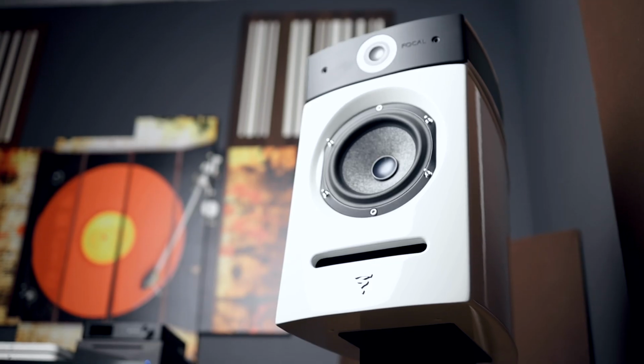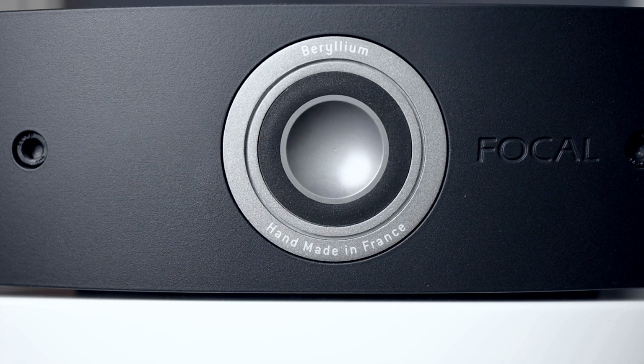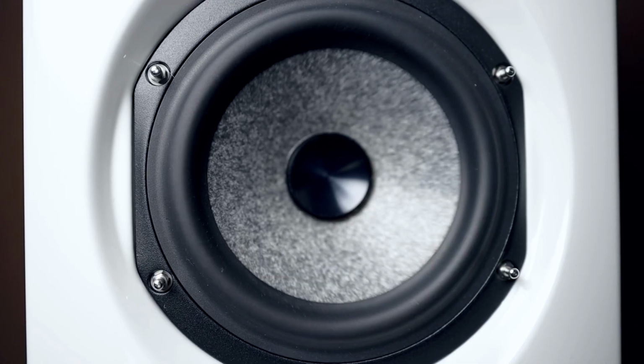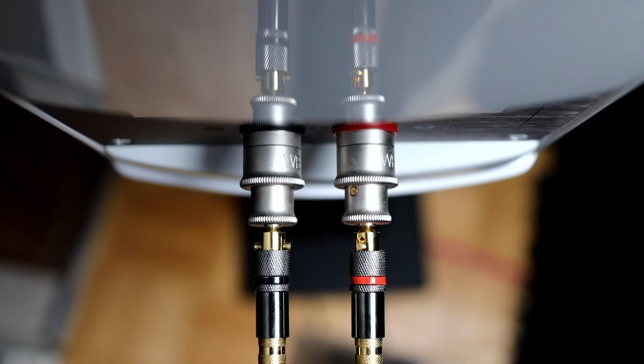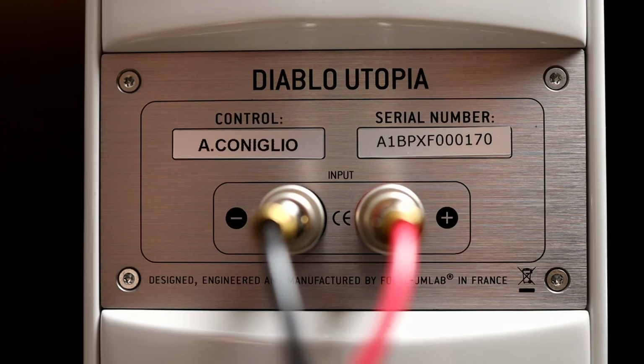Now, this speaker, when it arrived, I immediately unpacked it and found that these were pretty gigantic speakers. And just like any famous Focal speakers, it has the 1.1-inch inverted beryllium dome tweeter, and it has the 6.5-inch mid-range woofer with a cone made from Focal's proprietary W material, which comprises 2 layers of woven glass tissue sandwiching a core of Rohacell foam. And on the back, you can find the WBT binding post that they use. And I think that's it in terms of its design characteristics.